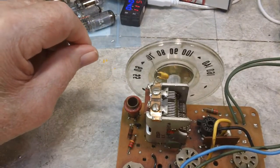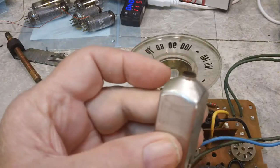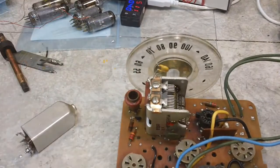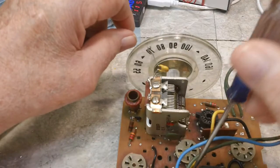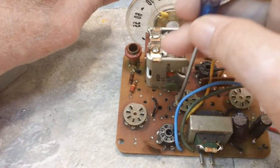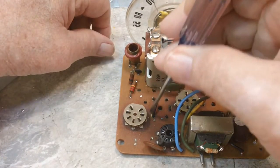Here is the chassis for the radio transmitter. I have put a jumper in here. I took the IF cans out of both of those positions, and I also took the loop stick out. I may reuse that mount for the resistor — not exactly sure yet. These two sockets are leaving, and there will be a 300 ohm 10-watt resistor taking their place. That's the resistor I was talking about mounting on that loop stick mount.